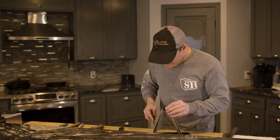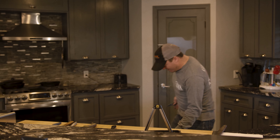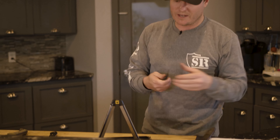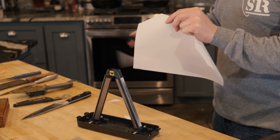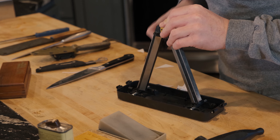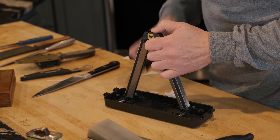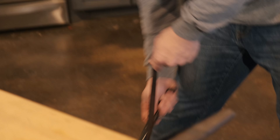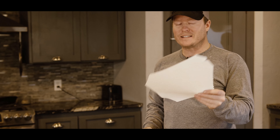What you're doing is creating an edge — one side will fold over into what's called the burr of a knife; under a microscope you can actually see a little burr of metal. At the end, when you think you've got it sharp, you take off your belt or a strop and that removes the burr — that's what they do at barbershops with razor blades, and it really finishes the knife. You know you have a sharp knife if you can shave hair. I'm gonna go a couple more times with really light strokes, getting lighter and lighter — that's how you sharpen a knife.